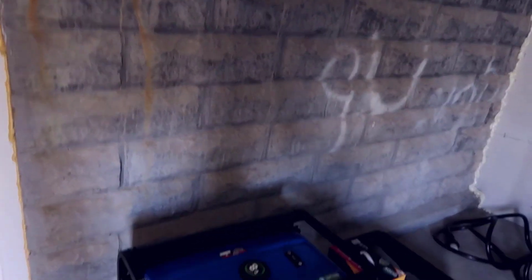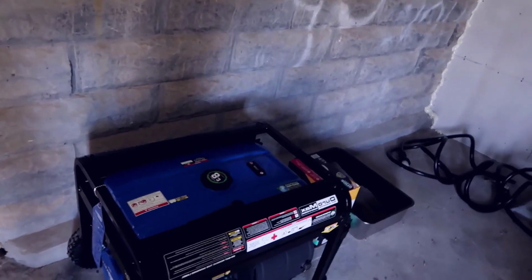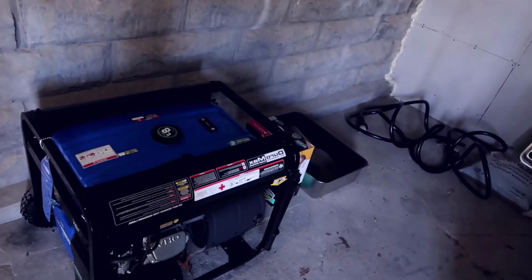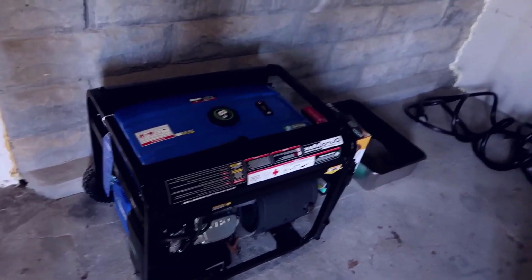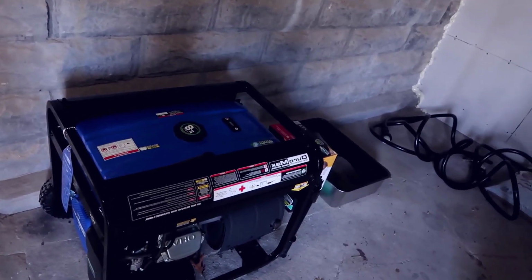And then at that point, during the power outage, all you have to do is run out to the Generac box, flip that manual switch, and when the power comes back on, all you simply have to do is power down your generator and then go flip that breaker back up, and your power will be restored right from the grid.